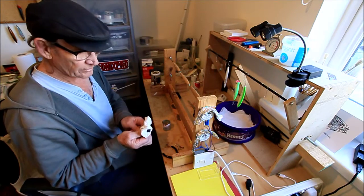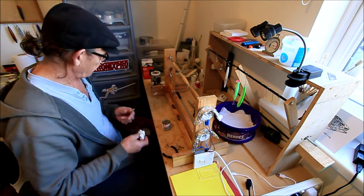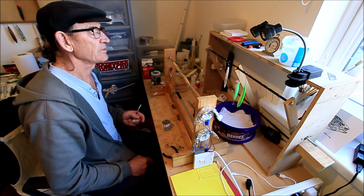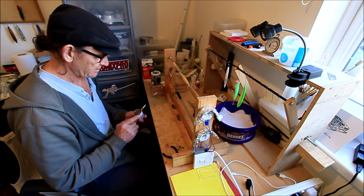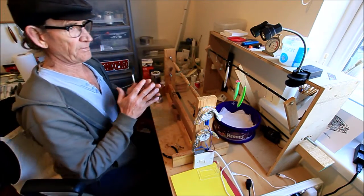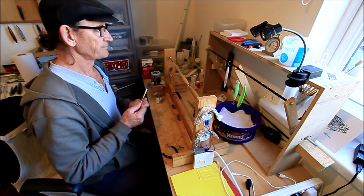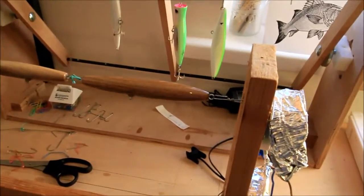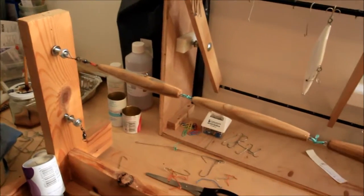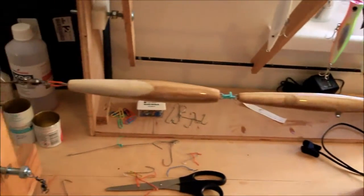That's that done for the next 4 hours. Then I'll put the next coat. This sets in 8 hours. Cures properly in 24. But after 4 hours you can do your next coat. It must be tacky, but it mustn't stick to your finger. That's when the next coat goes on, otherwise it doesn't bond properly, and you end up with layers which delaminate. Nearly done. There you go.